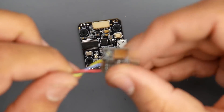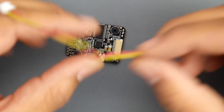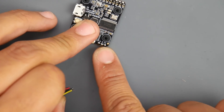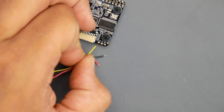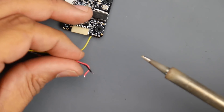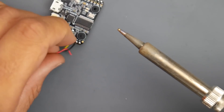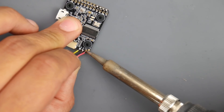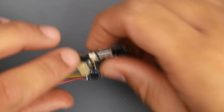Let's set up the camera wire together. We have video in, ground, and 5V. Since I'm right-handed, the solder comes in from this way, so I'll start with the pad that's most inside - that makes it easier as I move toward the edge, instead of accidentally hitting another wire and shorting something. Try to think ahead about the direction you'll be soldering and which hand you're using. My soldering station is set to 390 degrees Celsius, and we're all done - nothing is touching.